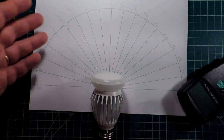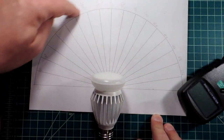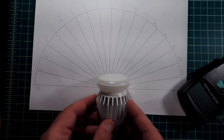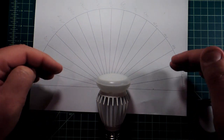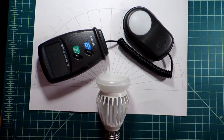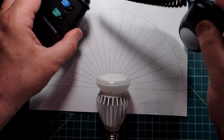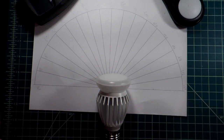In this part of the video, we'll take a look at how light comes out of the bulb. The traditional incandescent light bulb was pretty good — it was pretty consistent around the radius of the bulb, basically the same amount of luminous flux. LEDs are extremely directional and very small point sources, so one of the real challenges in optical engineering is to produce a bulb that has light coming out in a satisfying way. On first look, the bulb appears to be more of a side emitter than a down emitter. You can purchase a light meter for $120, run it around at a constant radius from the center of the bulb, record the numbers on a polar graph, and get a good sense pretty quickly of how the light comes out of the bulb.